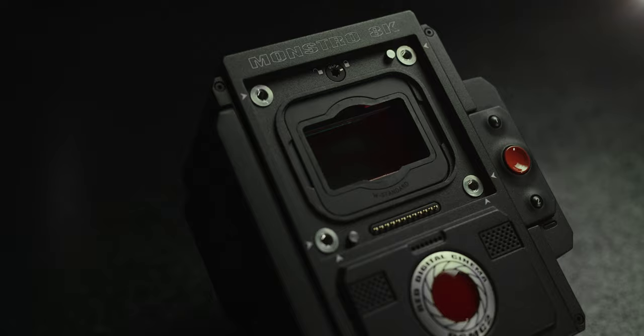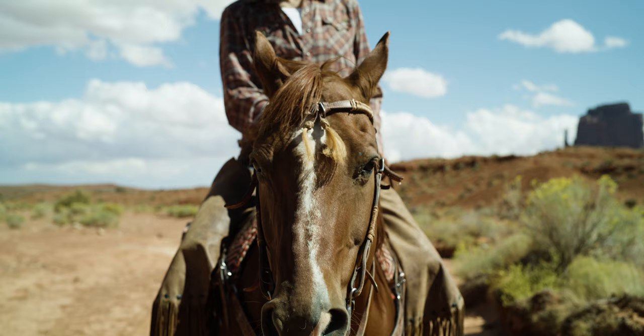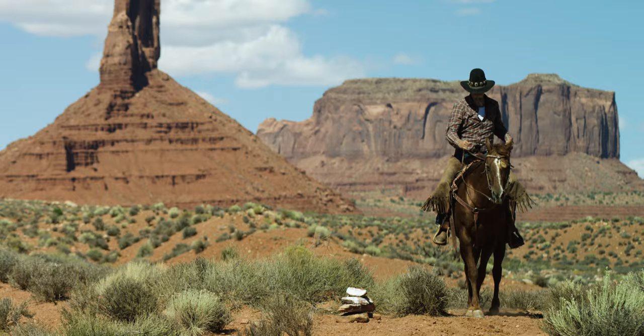Monstro — need I say more? This 8K Vista Vision beast is a magical mix of larger pixel pitch and higher resolution. Monstro is RED's largest sensor at full frame, with dimensions of 40.96 by 21.60 millimeters and 46.31 on the diagonal. There are very desirable effects that result from a larger capture area — that's why photographers have been shooting medium and large format for ages. Monstro maintains amazing clarity of focus in the important details but has a buttery smooth roll-off created by background compression and a shallower depth of field. Super sampling and a large pixel pitch means Monstro is clean — crazy clean.